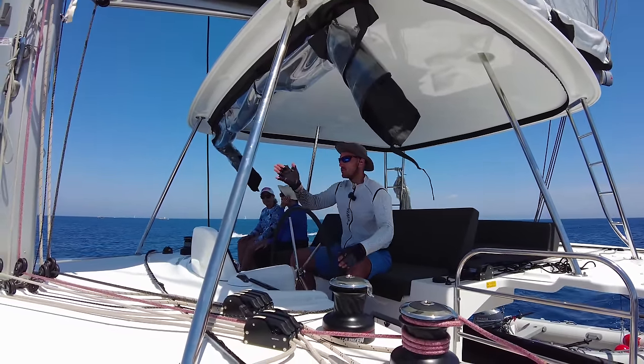Beautiful cliffs and just a perfect beach in front of us. But we'll have to turn, otherwise we're gonna be dry. So what I make sure of now is that I'm sailing really upwind, because I have to maintain speed. I have a lot of speed, so it's gonna be easy to turn. I check around, are there any boats behind me? You don't wanna turn when somebody is just overtaking you. And then once we're ready, we're gonna go manual, stand by, turn the boat quickly, and just tack.